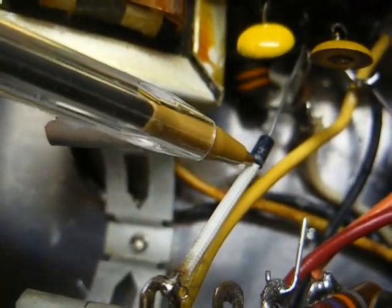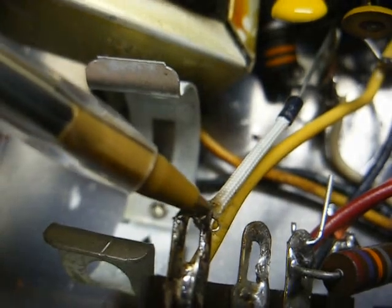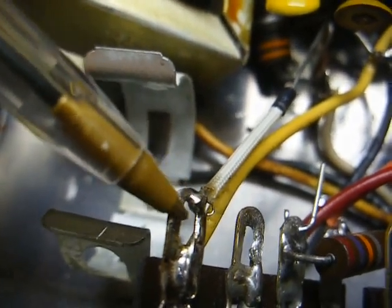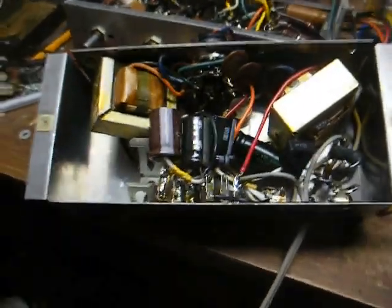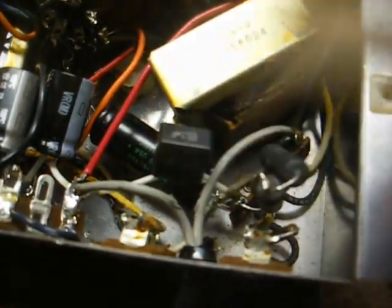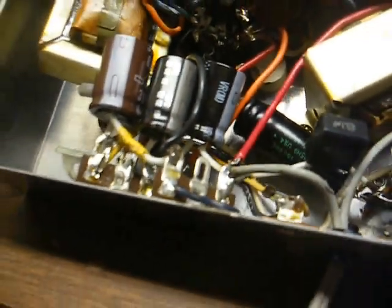Our cathode band here, as you can tell, connects to the first capacitor, or where the first capacitor is going to be. We just simply J-hooked our diode lead, wrapped it around the terminal here, crimped it, and heat our connection with the soldering iron. You heat the work, not the solder, and use just enough solder to get the job done. Okay, we have the filter capacitors mounted, as well as our two diodes, as well as the AC across the line capacitor, and we replaced this resistor here, as well as, wherever it is, the carbon resistor that was in series with it.